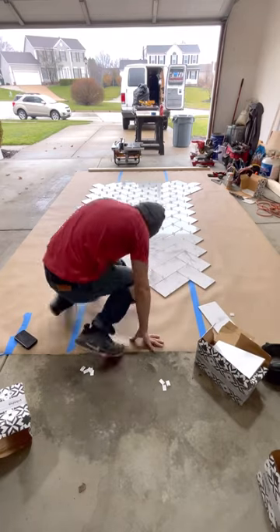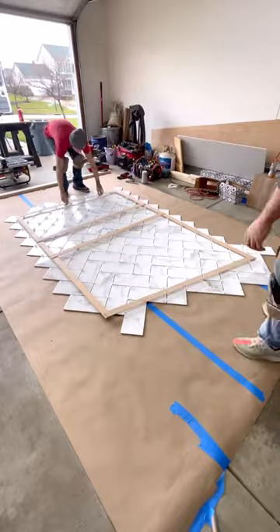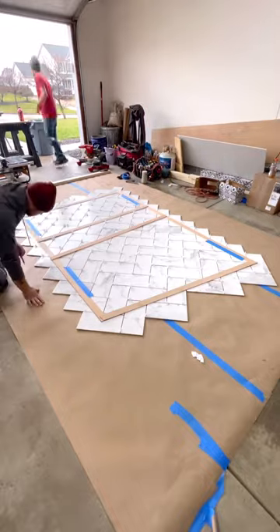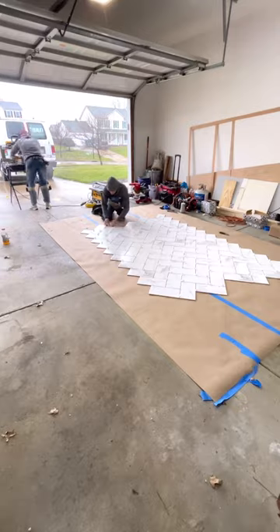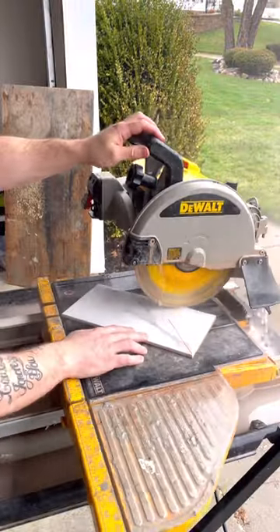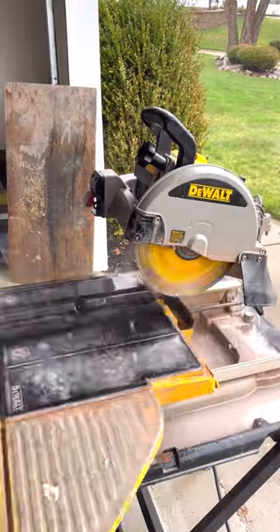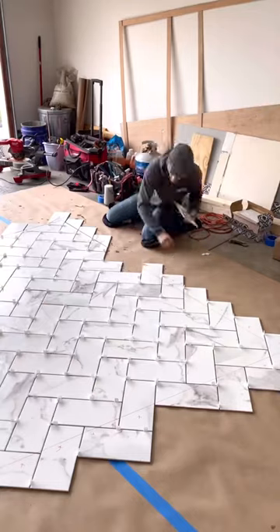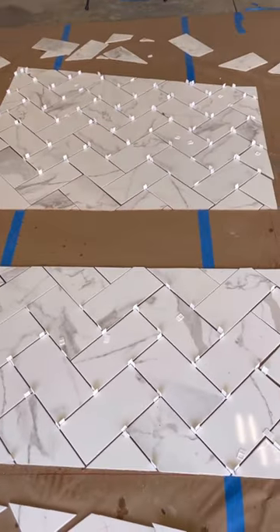Me and Kyle went ahead and made the template. We laid out the herringbone in the garage on the floor and simply put our template there, outlined it, and then cut all the tile around the template. We used the cutoff pieces to wrap the side walls, which also served as the starting point for our sidewall templates. This turned out really well — everything went together like a puzzle. Since this bathroom is on the second floor, by cutting everything in the garage we only had to cut it one time and then deliver it upstairs all at once.